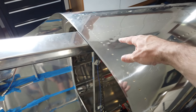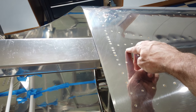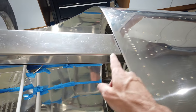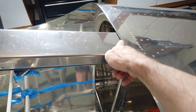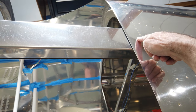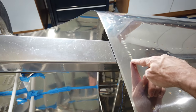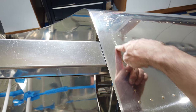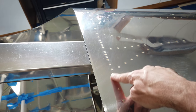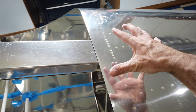A couple things to consider: there's a triangle plate — you can see it by the rivet pattern — that's underneath the skin. Make sure you don't forget to fit that. There's also a spacer between this piece and the skin underneath here, so don't forget to put that in. Pay real close attention to the rivet callouts because there are some different sizes — these are number fours in diameter.